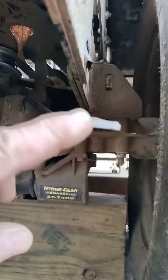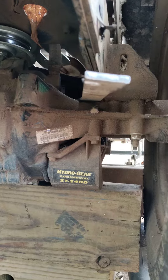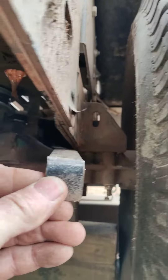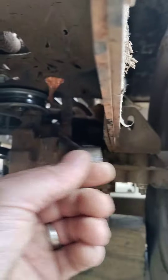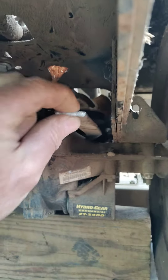What you'll have to do is cut these little tabs — they've got tabs on these plates right here. This is where you disengage your hydraulics so you can put it in neutral to roll it. You have to take a sawzall and saw these off, and then if you want, you can weld them back on once you get your bracket back on, or you can just take a pair of vice grip pliers and clamp it on right here and work it the same way.